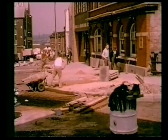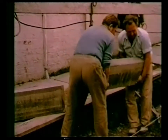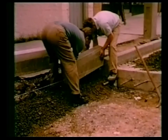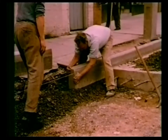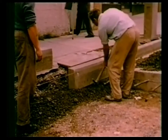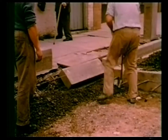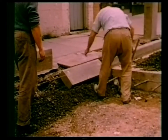Now let's see how the curbs and slabs from this press are used. Curbs are laid onto a semi-wet concrete base, lined up and backed with the support of concrete. These are 12 inch by 6 inch half battered British standard curbs, three feet long. Two men can lay 300 yards of this sort of curbing on well-prepared ground in a day.